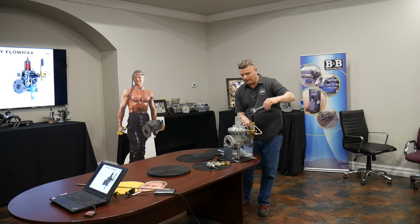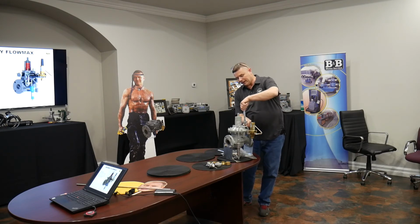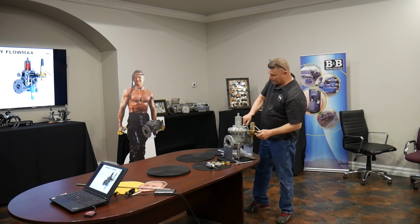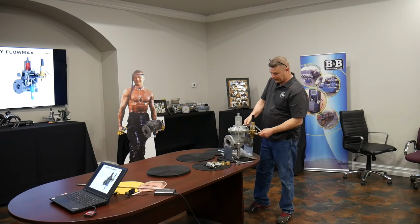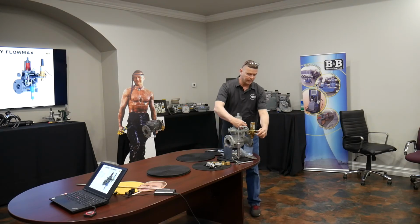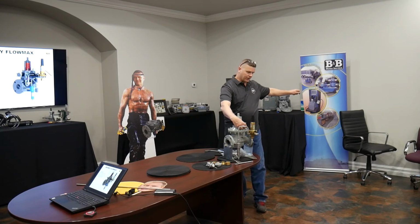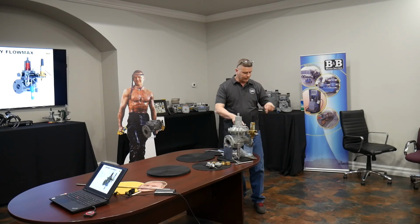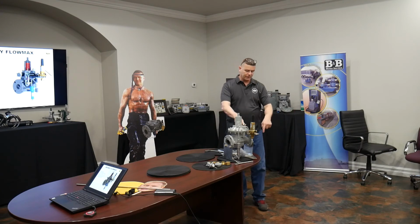We don't need it. The one thing that then has to occur differently is this gas that's up here has to still balance with what's downstream. Okay, so you need to run, if this is plugged, and we're running our sense line just like a traditional flow grid downstream from the pilot, then we run a return line between the two regulators that allows the gas that's up here to always be the same pressure as its outlet.